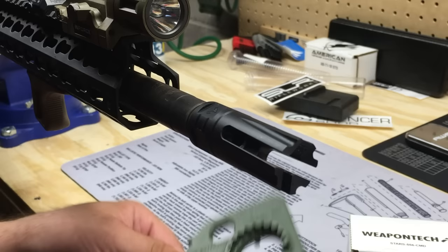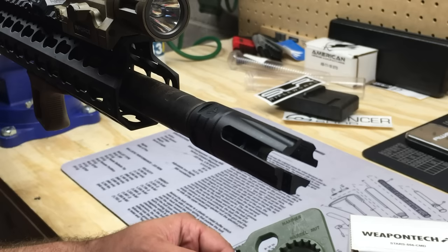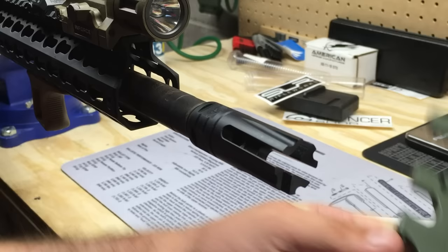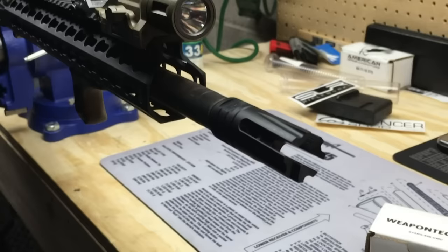While Rocksett is water soluble, I've let gas blocks sit overnight for 12 to 24 hours without it dissolving or helping one bit. What you want to do is take a brass hammer or nylon hammer and shock whatever you're trying to remove — hit it really good a couple of times with a mallet that won't mar the surface. That shock will break it loose and you can get it removed without issues.